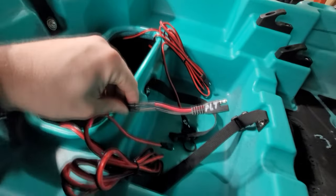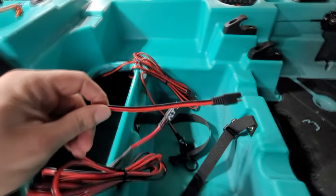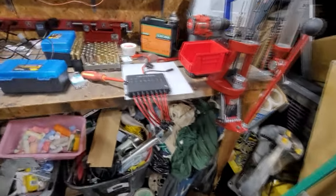My power is going to be right here. We've put a plug up forward — I've got the Navara fishing handle coming for the front. I'll be mounting a Railblazer mount for a GoPro camera off the bow off that handle. Then I'll have another one at the stern, giving two angles. We're going to route everything into here. I've wired up the plotter already to go into my switch. My two stern port and starboard plugs are labeled here: plotter, bow, stern port, stern starboard.